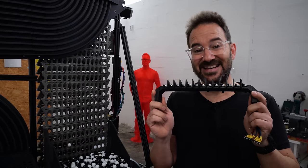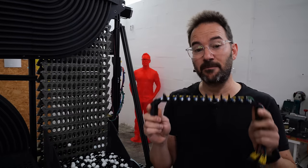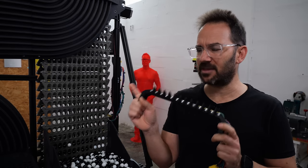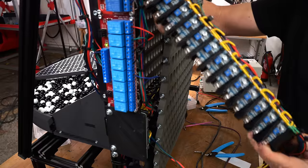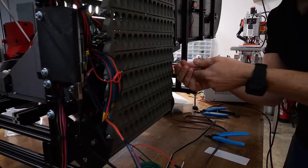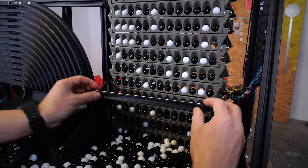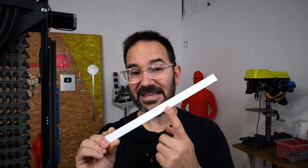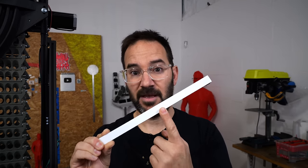But there is one thing that we can still not see: the gaps. So I'm gonna add an extra sensor bar calibrated to distinguish between marbles and gaps, and I think with this we will be able to roll some timing here in no time. We are using the fact that the marbles are opaque, so I'm going to install this plate in front of the sensors so the light can bounce off it. That way we will know if there is a marble between this and the sensor. Hopefully.